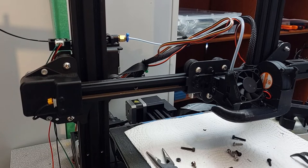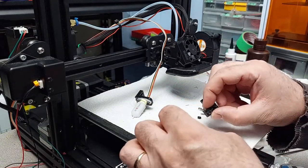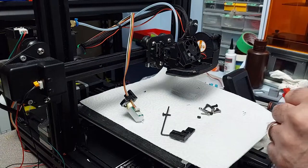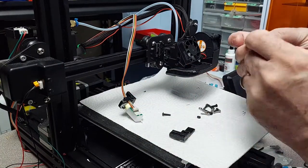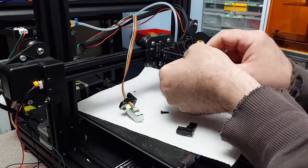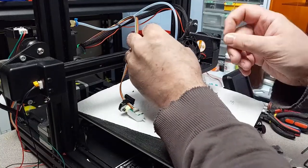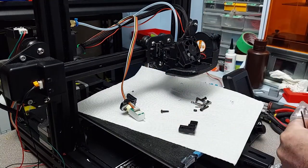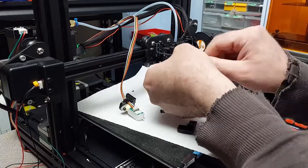I have a BLTouch, so I'm going to go on to the next step: install the BLTouch. I've already attached the BLTouch to the BLTouch mounting bracket. There's a small bracket that attaches between the BLTouch L-bracket and the modular system of the VoxLab mount. The small piece simply screws into the mount with a couple of M3 8s to secure it. Then we're going to secure the BLTouch to that — it has a bit of slide to get it adjusted just right. My original Z offset was about three and a bit, and now it's down to two and a bit, so you're going to have to reset your Z offset once you're done.